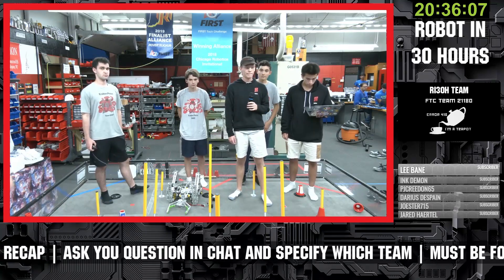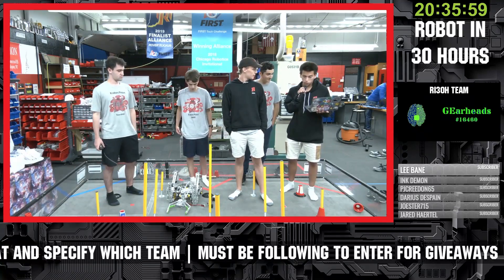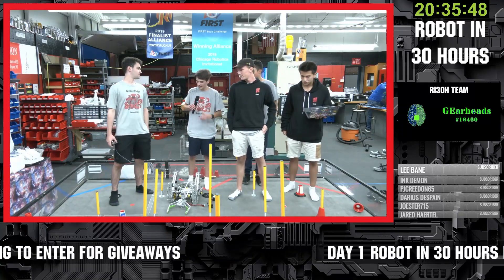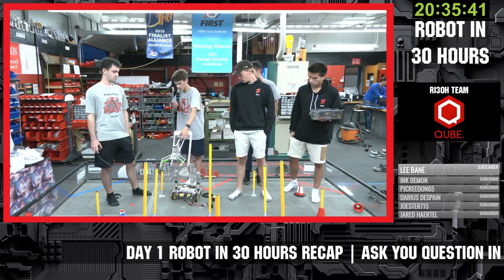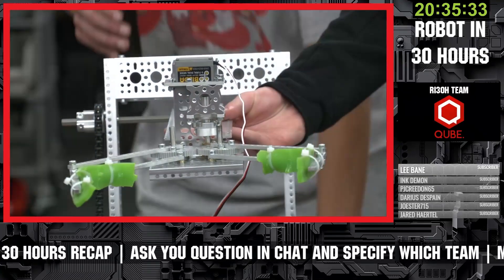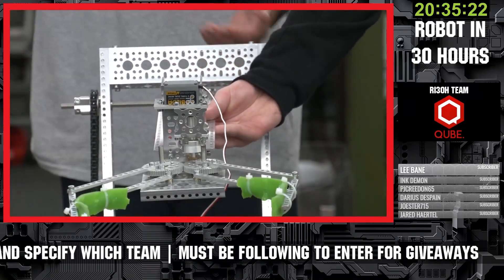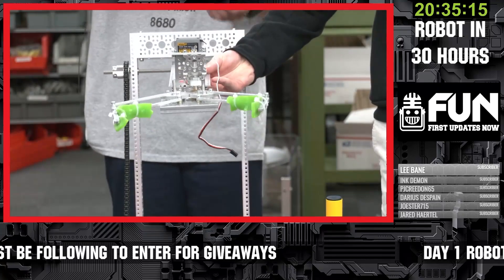From chat: Hannah F7 asks - is the last stage of the double reverse four bar a virtual four bar, and what led you towards that design? Yes. What led us to that design is - it's a bit hard to see but there's a chain on the side of it, and it allows it to be driven completely passively. This entire mechanism is only lifted by two motors, one on each side, so there are no electrical connections other than the one for the claw. We went for that for simplicity - this has a lot of motion, so we wanted to minimize all the cables to minimize what could get broken and weak points of the design.